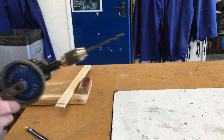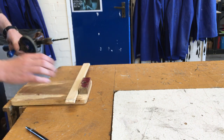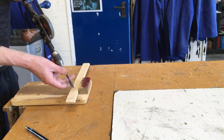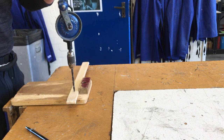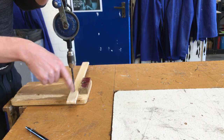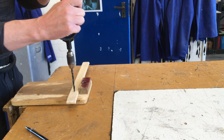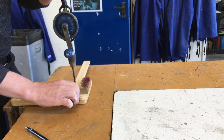The next stage is actually doing the work. I've already marked out my point. We place our work here, and I'm using a bench hook to make sure I'm steady. I'm going to line up my twist bit with the centre of my hole, apply pressure downwards from the top, and rotate my handle in this direction. That spins the drill the correct way for it to cut into the wood properly. The reason I put my wood against the bench hook is so that if my wood starts to spin, it will hold it in place and not move.